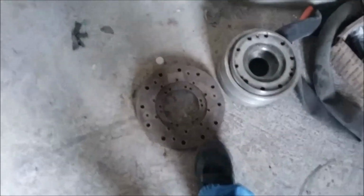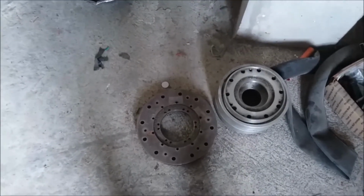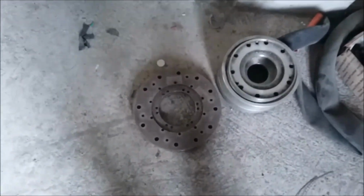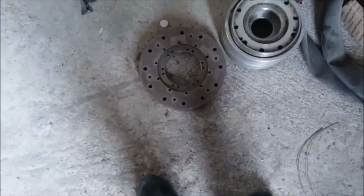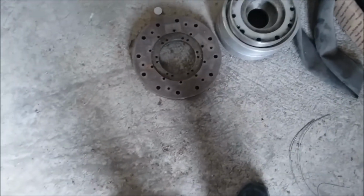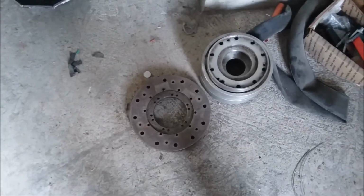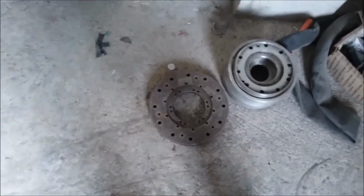This down here is the flange for where the blades for the fan go on. It goes on a 3-inch shaft. And that's welding hubs over there with one of the hubs, and they fit into this recess to center it up. And the bolts go through one hub through this center and bolt to the hub on the other side. I have to open up the holes on the center, that's a 5/16 hole. We drilled the 5/16 pilot holes on every hole, and then we come back and line bore everything. So some of them are to finished size, but those particular ones are not.